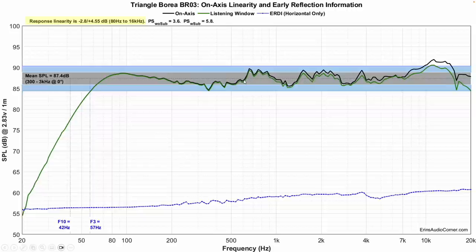This dip through the mid-range certainly accounts for what I was hearing. There's a boost around 700–900 Hz that's interesting. Looking at the port and drive unit response, my hunch is that this area is a baffle step issue that's not well compensated through the mid-range. This dip I believe is likely the port causing some out-of-phase cancellation. The enclosure seems well braced and well stuffed, and the impedance doesn't show dips or peaks in that area, so my best guess is that it's an issue with the ports themselves rather than an enclosure resonance.